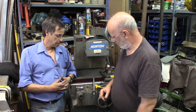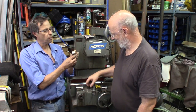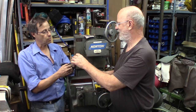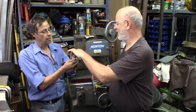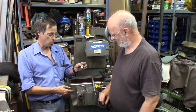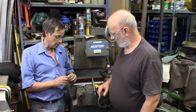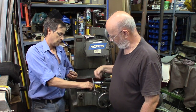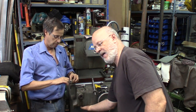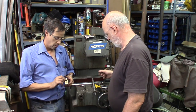To make the two halves — which didn't used to be two halves — we drilled and tapped with an aluminum plate in the back. In order to get the shaft through there the screws have to be loose, so we drilled and tapped a couple of holes in the side where we can access the two screws and put some set screws as plugs so no chunk gets in. Because we had no room to use an Allen key under the table, we can access it to put the two halves together by hand underneath there.